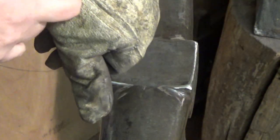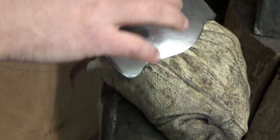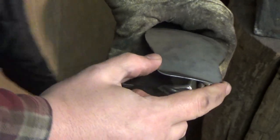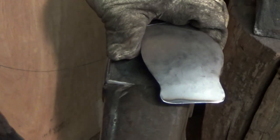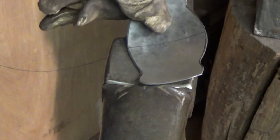There we go. Realistically, if I go putting that across a wrist it's going to hurt quite badly there, but by the time we've pulled those edges down this will smooth out because it will lift those edges up a bit. It's a bit aggressive there but I'm not too bothered - I can always touch it back out again, it's only a couple of knocks with a hammer. We're going to put in flutes and all sorts of things across this, but I just want it smooth so that when I check the action in a bit we can be sure it's working nicely. I'm going to get the other one up to this state as well and then we'll move on.